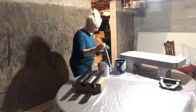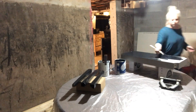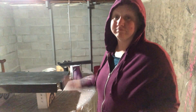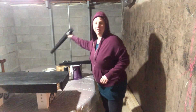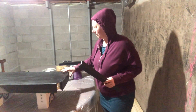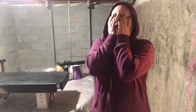We left off with me putting the first layer of black paint on the bench and feeling rather proud of myself, but I regret to inform you — I have bad news. The black paint reacted with the primer, which is the one thing I didn't test for because I've never had that happen in my entire life. The reason I know it's the primer specifically: I have this one leg where I just used the black paint and it looks gorgeous, but everything that has primer on it is sticky like gum. It's really gross. So I can't use primer with this paint.